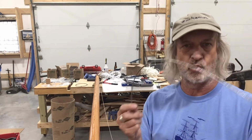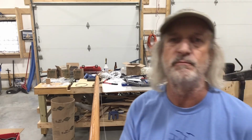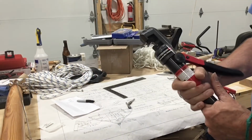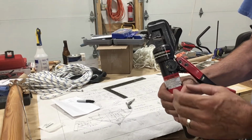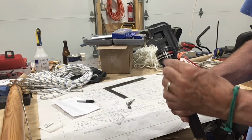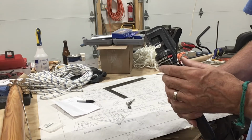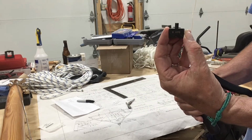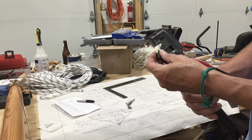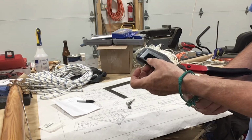So I just have to make 2 more like this with the terminal jaw on the top, because I can fit that at the top, and then we'll do the turnbuckles later. We'll do a crimp so we can see how this works. So this is a hydraulic crimping machine. That's off, so the jaw's relaxed, that's on. Then you just pump it like a hydraulic jack. I'm using the number 6 dies. It seems to be pretty good for the size of these forks that we're crimping.